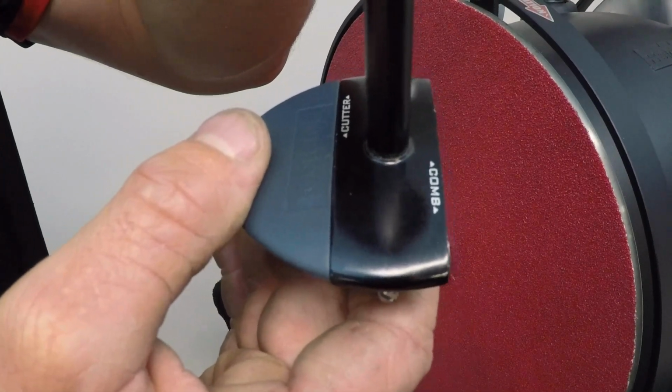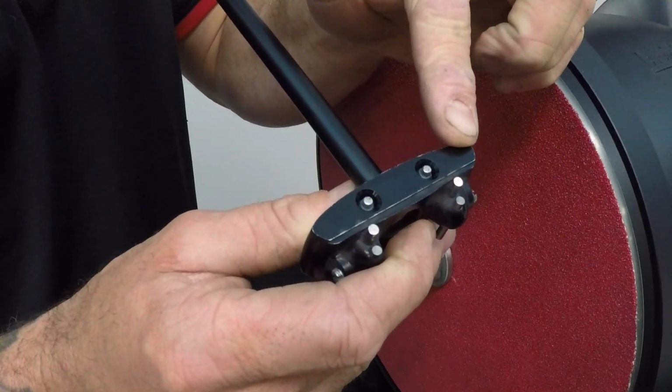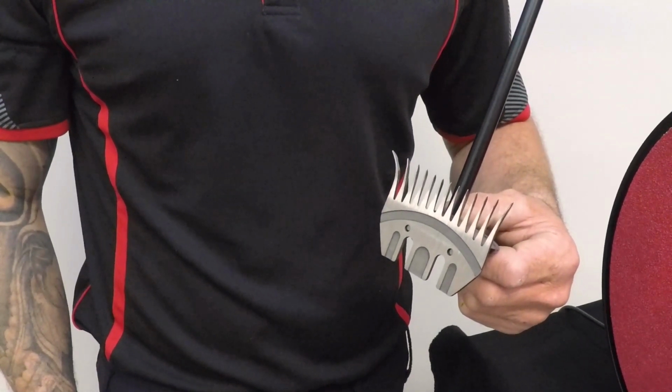Heiniger pendulums are double-sided. The comb side has pins closer to the pressure bar. Attach your comb to the comb side. The power handles have magnets in them, which hold your comb and cutter in place.